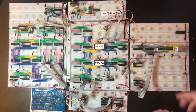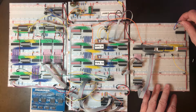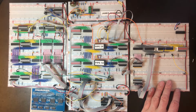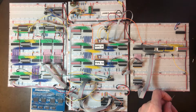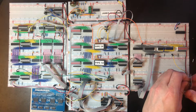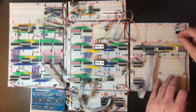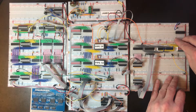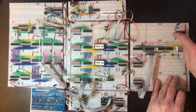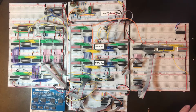Here we've got these 2 active low enable lines. So I want to bring that one high temporarily. Okay, so if we bring this line low, that means this will control the output of the line driver. And we need to connect the outputs here into the inputs up here.